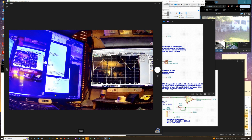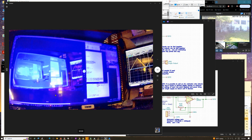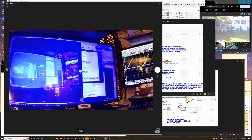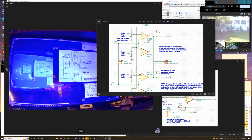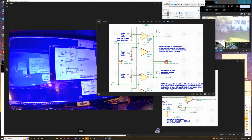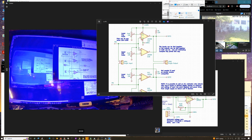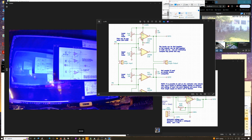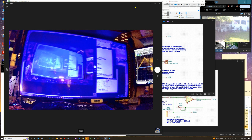But you do have a good signal. Even with this capacitor, apparently you do have a good signal, because we've gotten rid of one of the big filter components, because the impedance of the chip's inputs is probably going to be relatively high. I don't think on these 339 comparators they're as high as an op amp typically is, but still it's probably going to be at least like 50 or 60K, I would think. So that's pushing that filter frequency down, because it's such a large resistance.